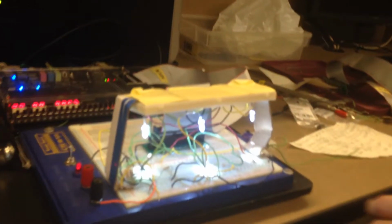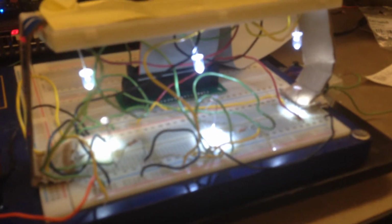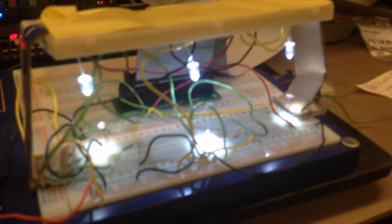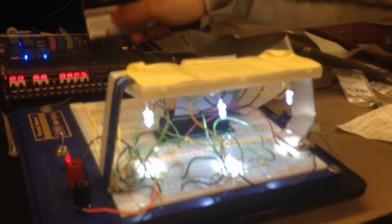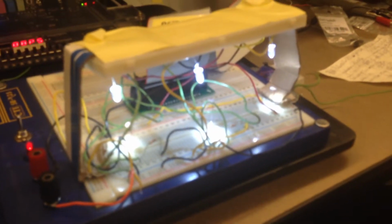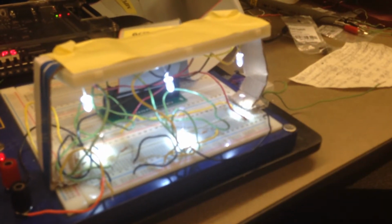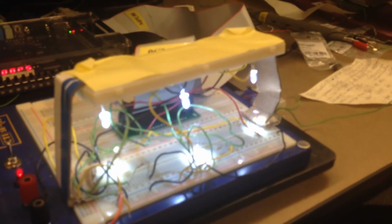And then there are some things that are a little different from our proposal. One thing is that we use LEDs and photoresistors instead of infrared sensors, because infrared sensors are not as sensitive. So we think this is a better alternative with a similar output. Another thing is we added another 7-segment display to show useful information about music. You know, C is do, D is re, and E is mi, which is useful to the user. We also didn't add any lasers because the LED already serves as a light source. So those are the things that are different, and this is basically our project.